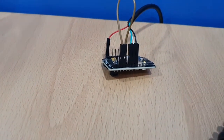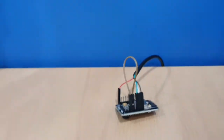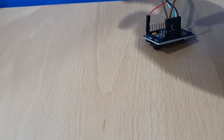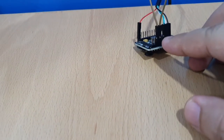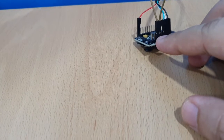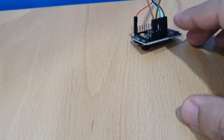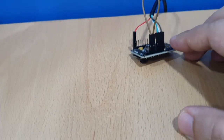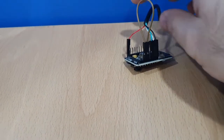This is my small device. It's connected with a CH340G, and the pins that you need to be aware of, you can find online as well. So there's a 5-volt here that I connected, and then this is ground connected to, I think, input 0, and then this is the transmission and receiver. And then this one to ground. So I have a CH340G. I installed its driver and then connected here.